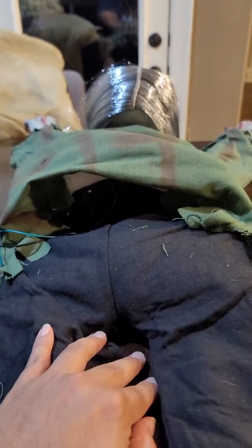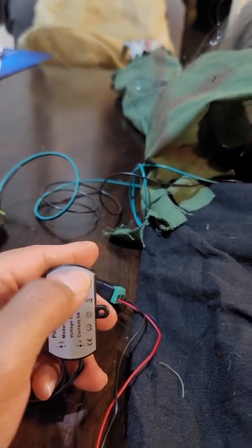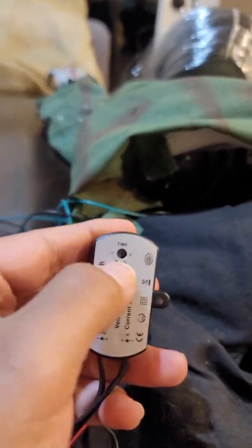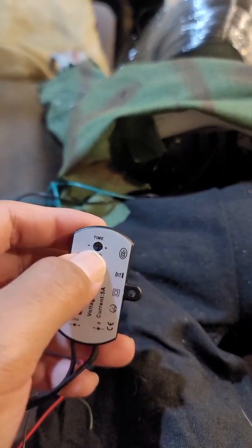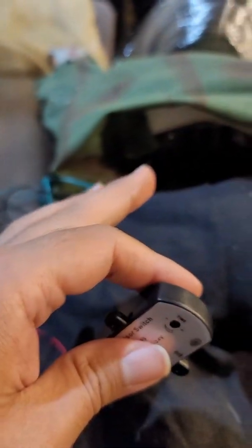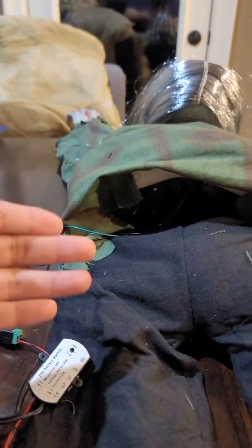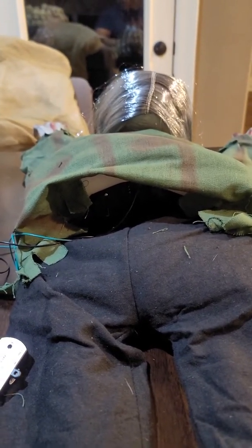This all depends on what the decoration does. Some decorations talk and some just move — this one just crawls around. If you set it on the five-second interval and the decoration is saying a sentence, it might cut off mid-sentence, so you'd need to increase the time interval. Once the interval completes, it shuts power off to the device. Then when anything comes in its path and the sensor detects motion, it turns on again and does the cycle all over again.